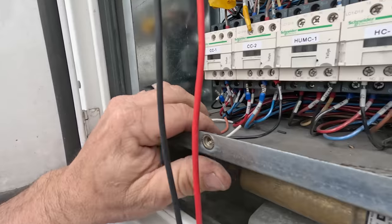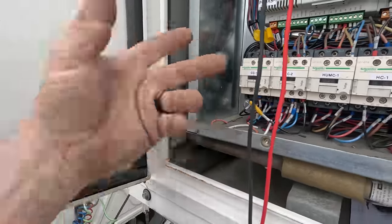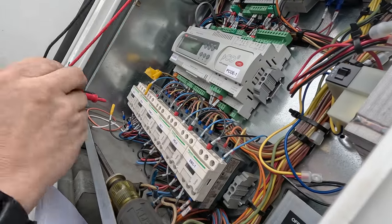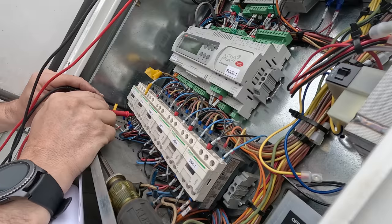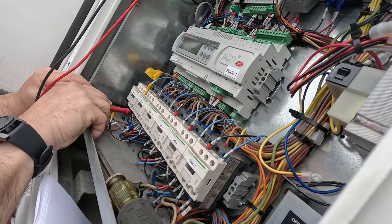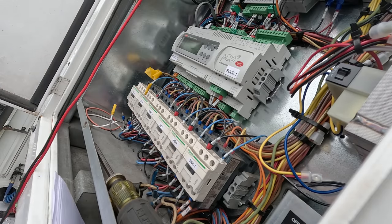We've got these three terminals here unhooked from it. These here have nothing to ground. Of course, I didn't check between them. Guess we can check between them, see what they are between, which got paralleled with the condenser motor. 3, 3, 3. So they're all pretty much equal. That's a good sign.